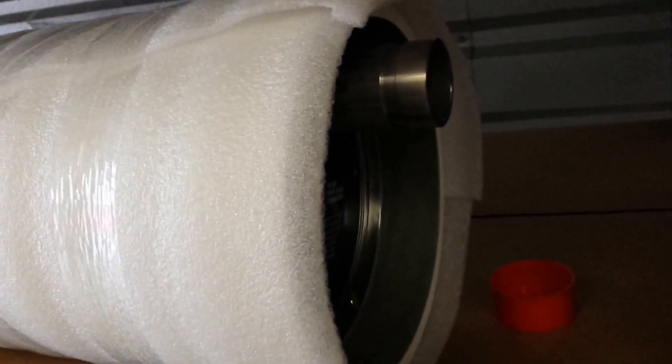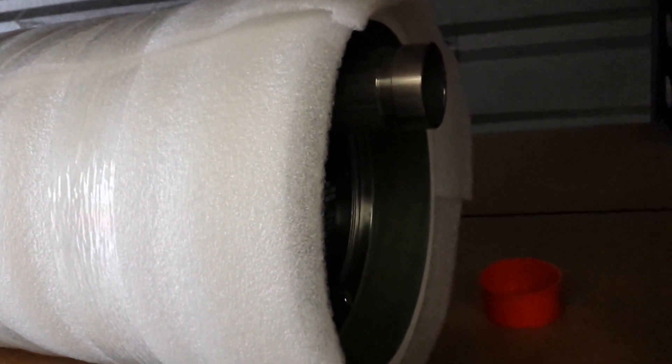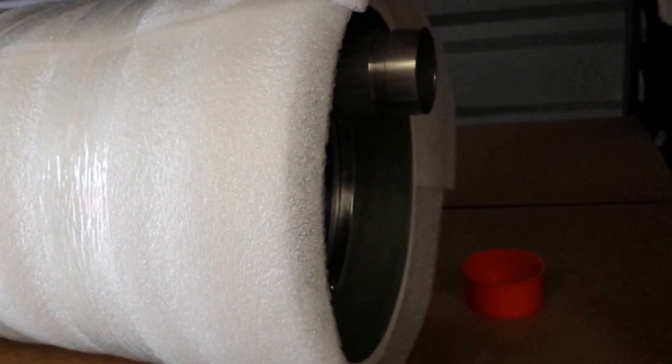The 80 is because it is an 8-inch pressure vessel. E is for end port — it has two end ports on it. And this is an IPS grooved M port.